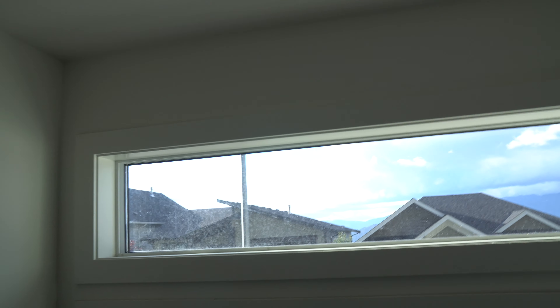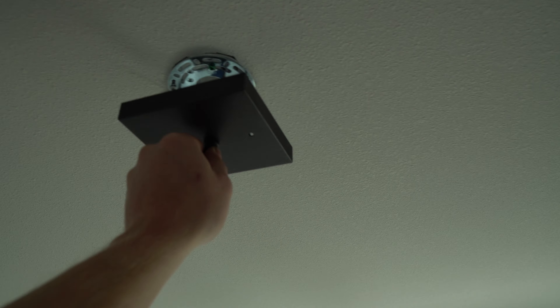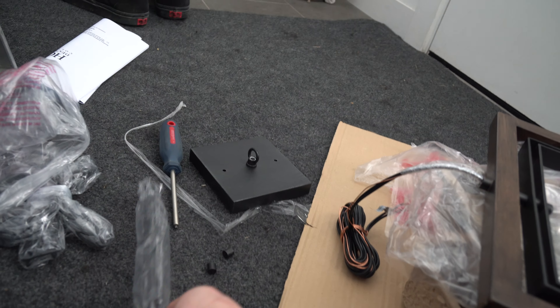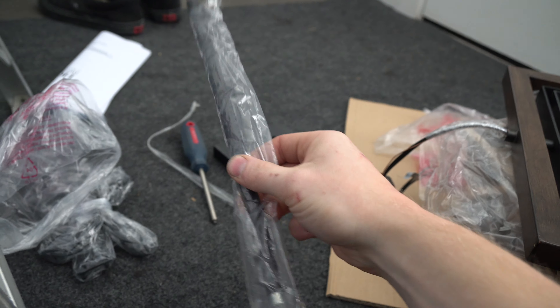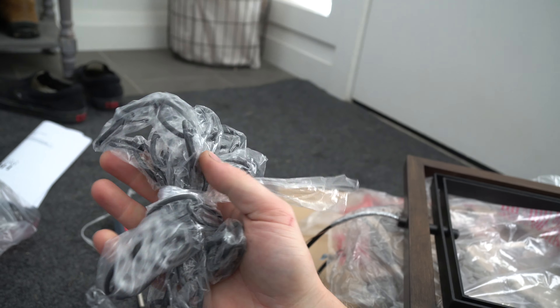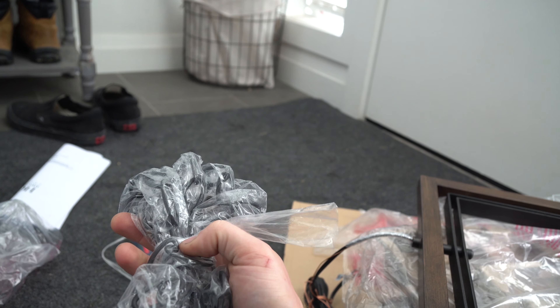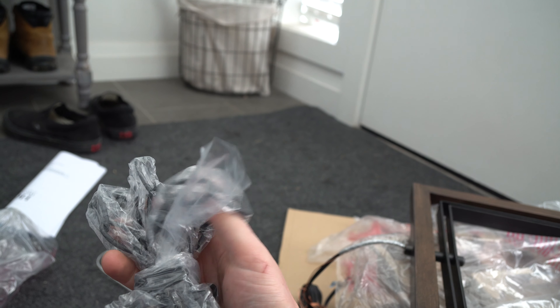That plate left up there — you have a choice: reuse it and move the screws to where they should be, or simply remove the old plate and bolt the new one up. Make sure you put that mounting bracket exactly square how you want it up there, because if it's not perfectly square, when you go to put the fixture up it won't sit square with the room. Also make sure the ground loop goes back on the green screw, which connects to the green wire.